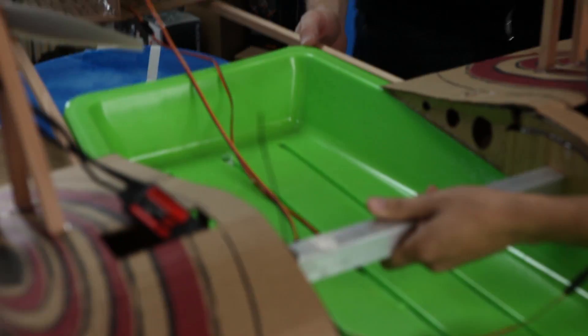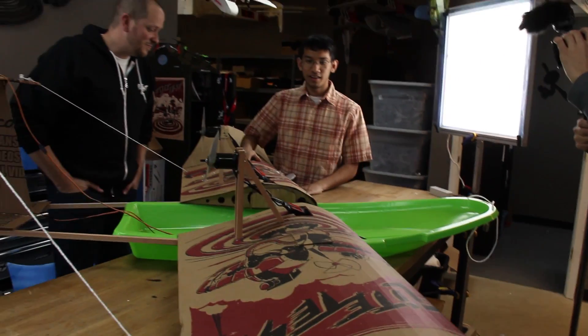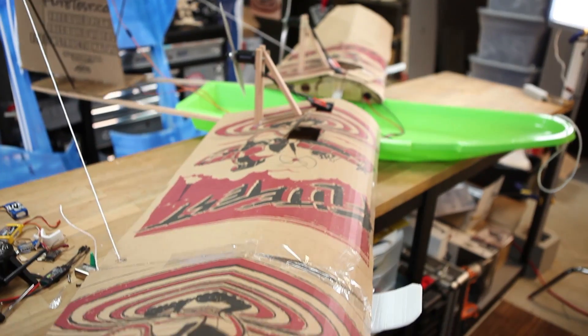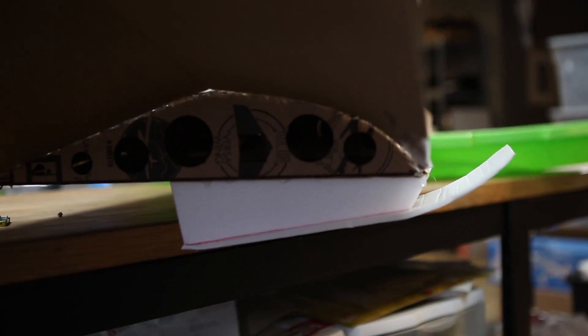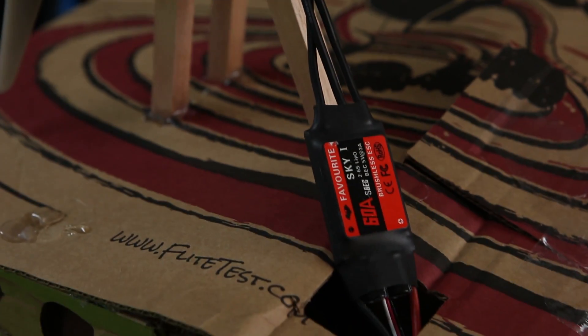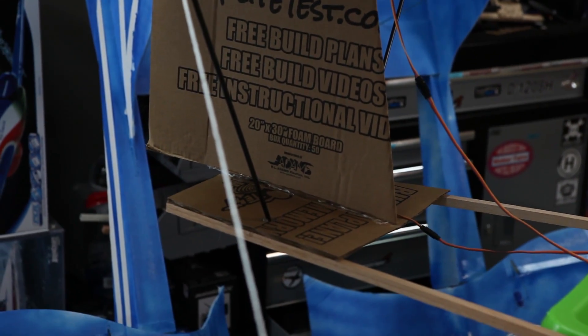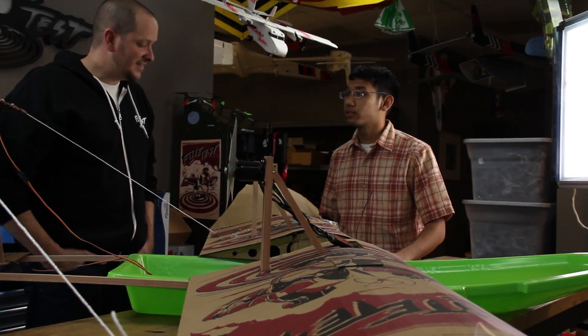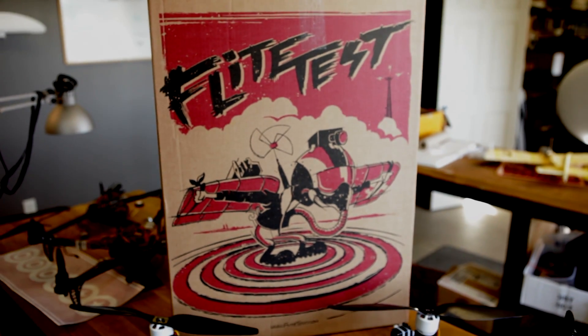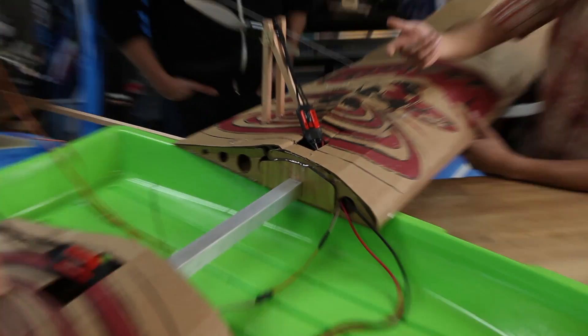Sure. This is very awkward. Mine's about 100 inches wingspan — yours has to be bigger. I played with cardboard. I wanted to try something a little different as a precursor to something I might try in the future — more on that later. I wanted to try cardboard for an airfoil, and surprisingly it turned out pretty well. This is the remains of it — it's been beat up, got dings and dents, it's buckled here, broken there. But for the entire flight and the time we used it, it worked great and stayed in pretty good shape. You didn't build a spar here — you used a remainder of something left over. These are actually our Flight Test foam boxes — that's what these are made out of. There are about four ribs on each side.